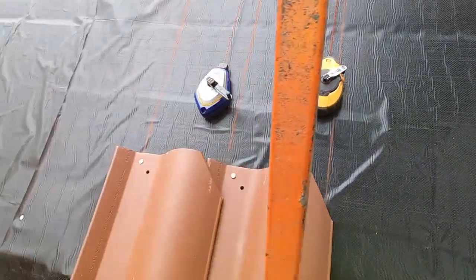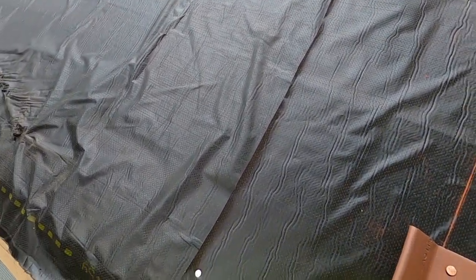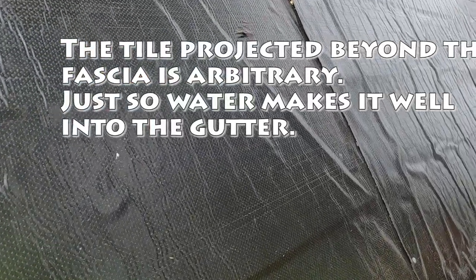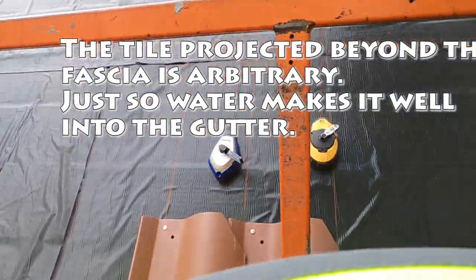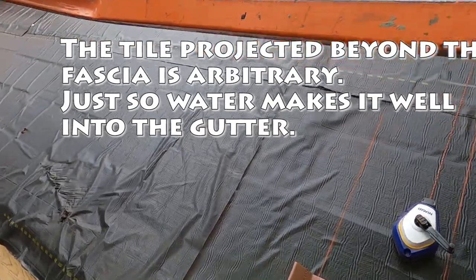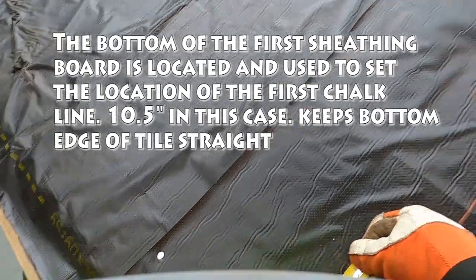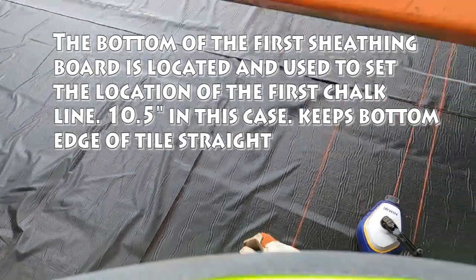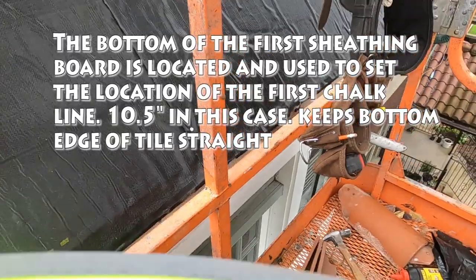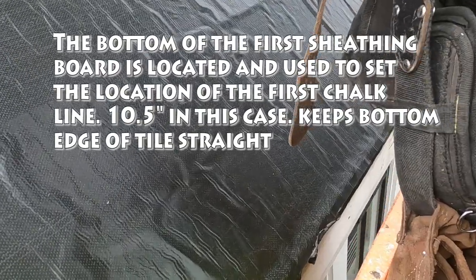Now, what we have is a certain distance up from the edge of the roof. It's set back from the fascia almost all the way across. And if we're lucky, if anything's consistent on these older houses. So this is, what, 10.5 up in there. So we'll go down here and measure and mark 10.5